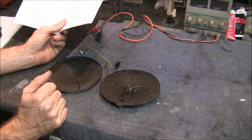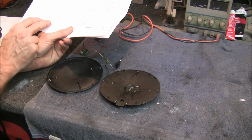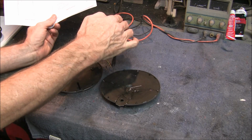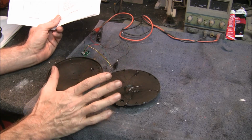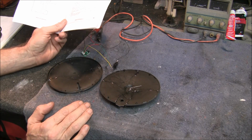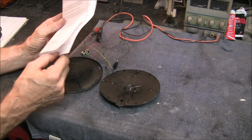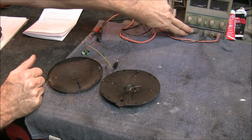Now on the positive side, they all connect to the same wire, and you can see what they've got here is a jumper wire that you run. So on the red wire coming in for our power, we just run a little jumper wire over, and then we connect that to all of the positives. So every positive that you're going to connect on here, every LED or SMD, whatever you're going to use, all connects to that same one. So it's really straightforward and really easy to understand, like we said. And so now I can turn this on for you guys.